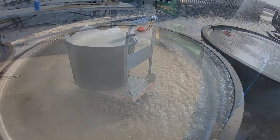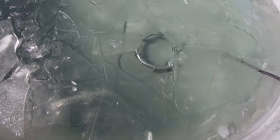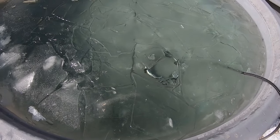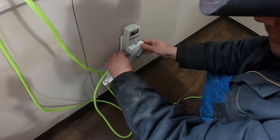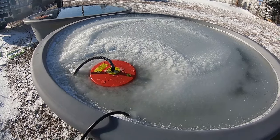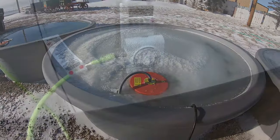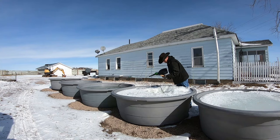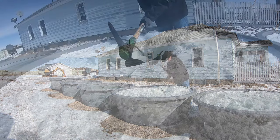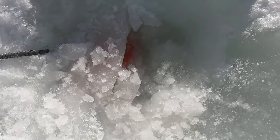As for the heaters, we quickly ruled out the bubbler. When it came to the sinking tank heater, it didn't keep the ice open very well either, although it is much thinner and easier for animals to break open themselves. It did use less power, at only about $2 worth of power per day. The floating tank heater on the timer seemed to save power once we got it figured out, but allowing it to be on only at night didn't solve any issues — the water froze during the day and the heater was unable to thaw it by morning. When we switched it to a 2-hour on, 2-hour off program, it was able to keep most of the ice off the tank — until the tank heater failed and froze in place. I'm guessing the constant on-and-off cycling caused an internal component to fail, and we'll find out once I can get it out of the ice.